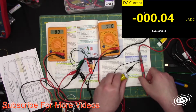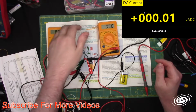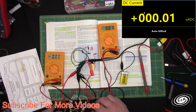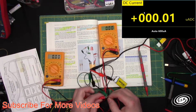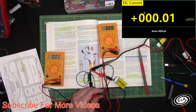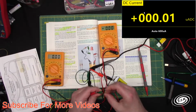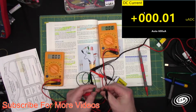So now we are going to change that resistor, and we're going to see what happens. We're going to leave these set up so you can see this. I'm going to reverse these. So this is next to where the diode is, and this is down here by the resistor. This is just insane to build a circuit like this with all this wiring. So I'm going to come in here and I'm going to change this resistor. So I'm going to put the 1K in. So 1K is going to be brown, black, red. So connect it to the circuit, and we'll connect it to the meter for the voltage drop.